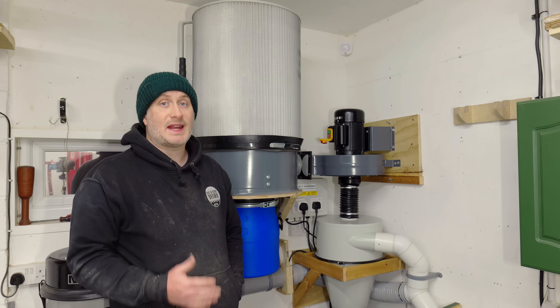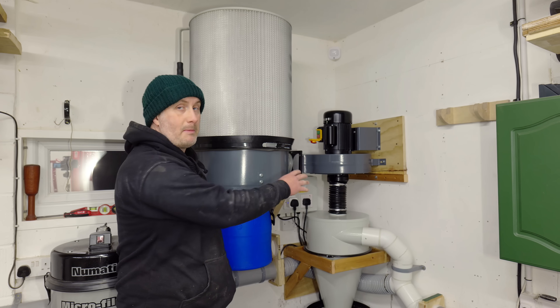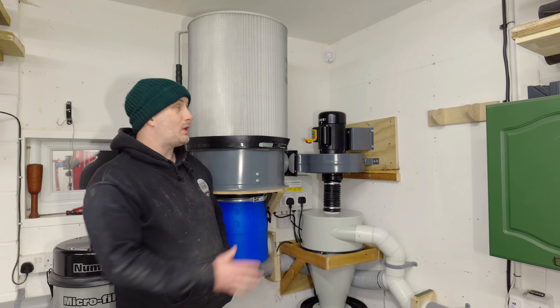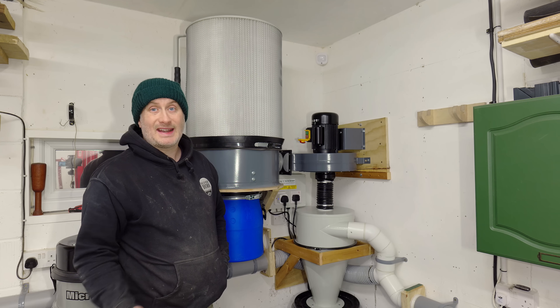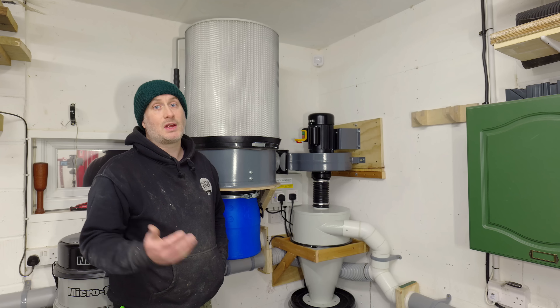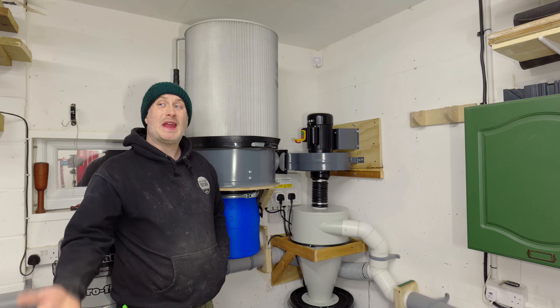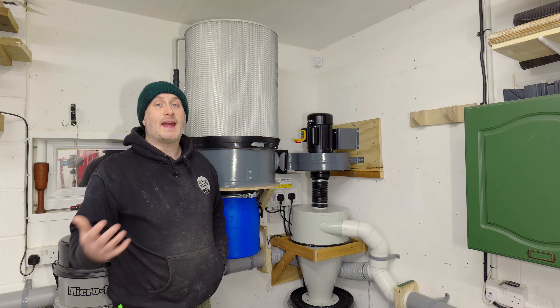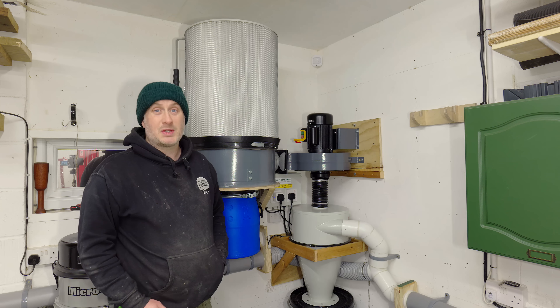Another option for installing a two-stage system like this is to completely forego the cartridge filter and direct the airflow from the motor directly to the outside. That's going to save you loads of space in your workshop and mean the extractor can exhaust air really effectively, but there are some downsides: if your workspace is close to neighbours or pedestrians you're basically going to be polluting the air around them; also if you heat your workshop all of the heated air is going to get sucked up and exhausted outside which would make for a chilly working environment very quickly. Oh, and noise pollution is another thing you might want to consider.